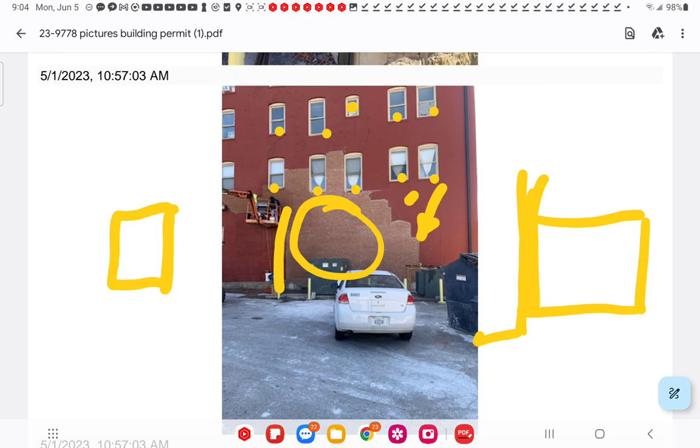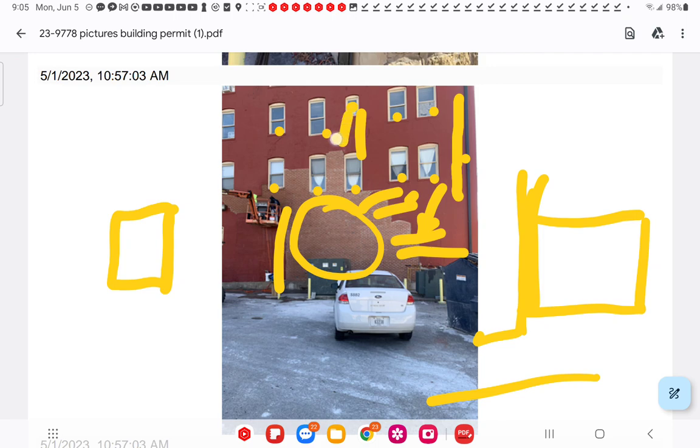You know, where do you put it? Here? And then consider this a panel out to here? That's very risky out to that edge without some connection. And again, I showed you they didn't use Helifix type Helical coil or metal, anything to tie it across. I showed you they didn't do that. They just considered this a sound operation by putting new bricks on the old bricks with this mortar system butting up to here, not thinking of thermal expansion.